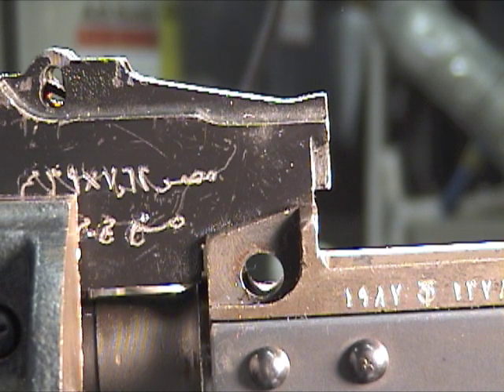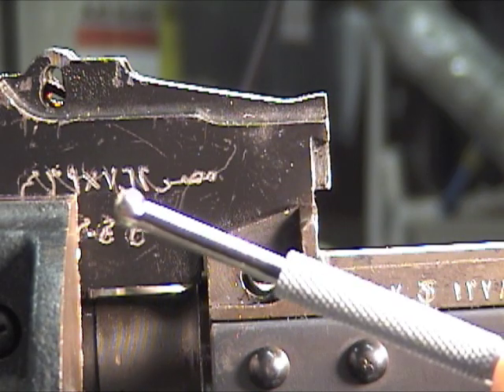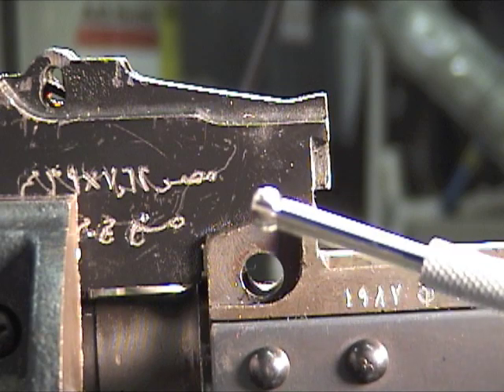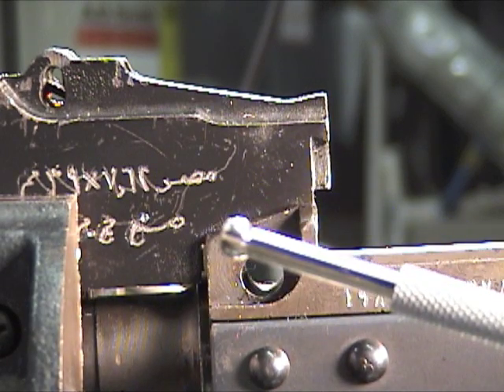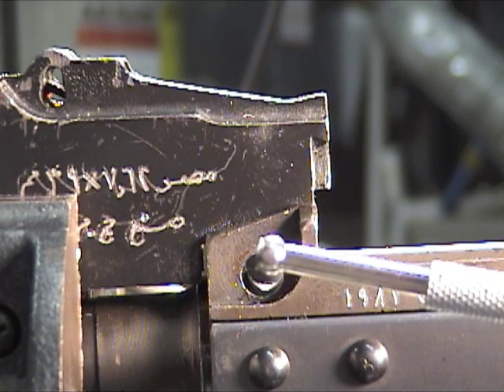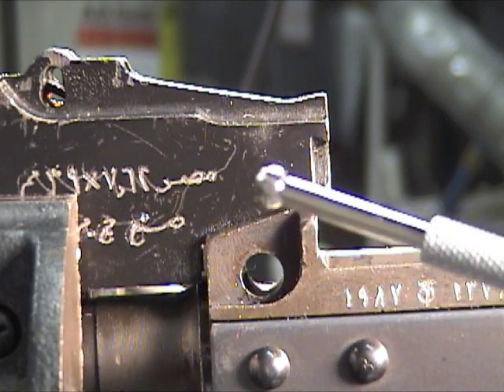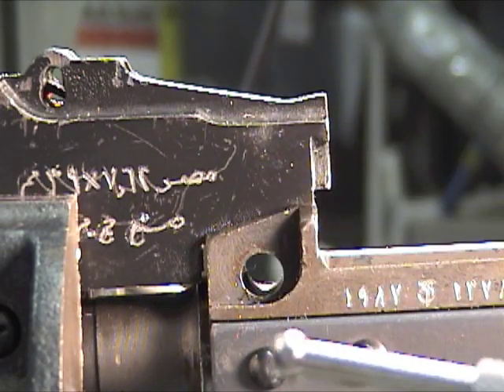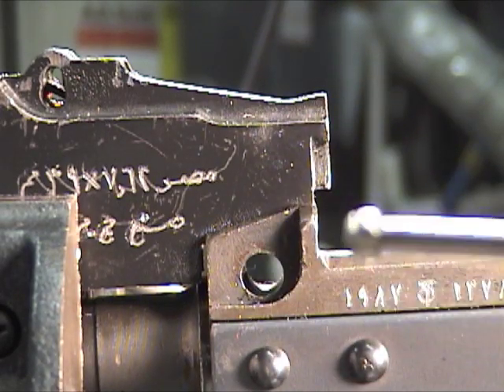Something I like to do is use a tool like this — a pin gauge or hole gauge. LittleMachineShop.com sells them periodically when they have a sale. I think I paid ten bucks for a set of four in various sizes. This makes it very handy to get an accurate measurement so you don't have to make the pin any larger than you need to.